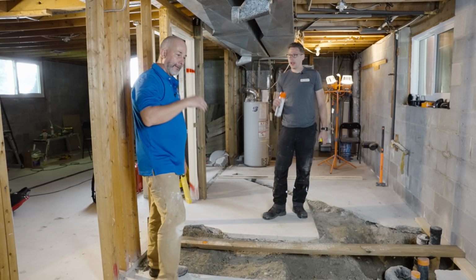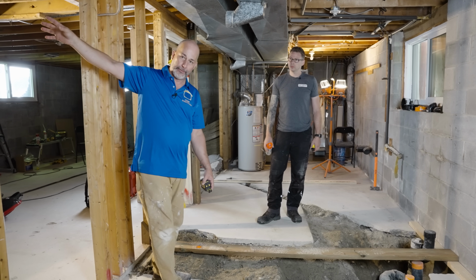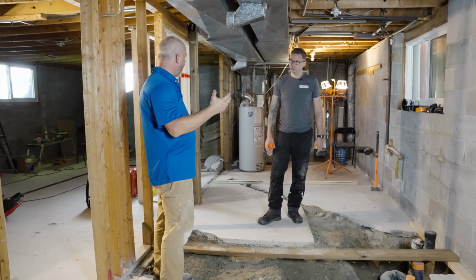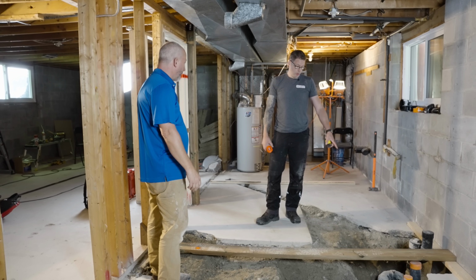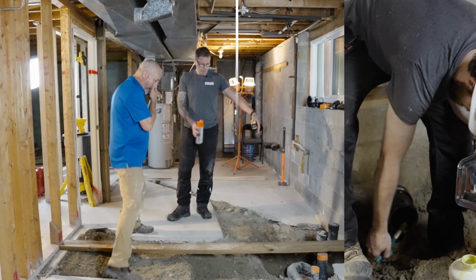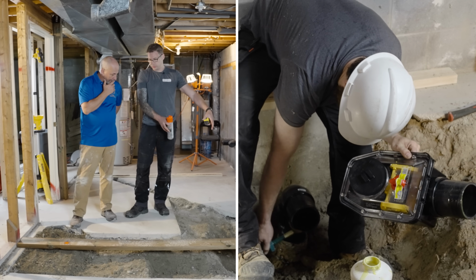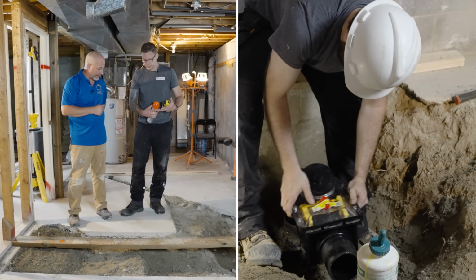Done. Again, we're really thinking the whole project end to beginning here, but we got to get a bathroom on the other side of the house for upstairs. We're going to need a line for that. That's right. What's the best option? So we have to pick up off of all of the plumbing here in the floor. We're going to put a device called a backwater valve. That's basically just going to protect you from exterior floods, rainstorms, city backups, things like that.